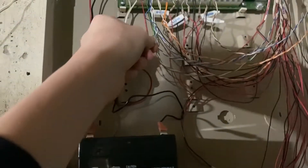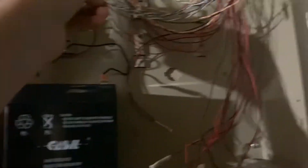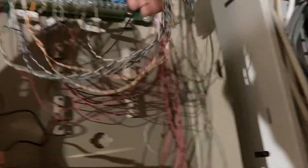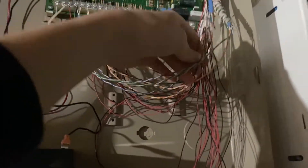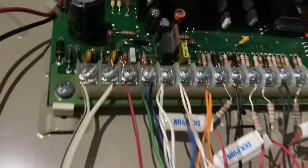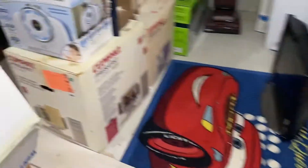Contacts three and four - I don't have the schematic right now but it's three and four. Right here is pin number three, and this is the wire for the speaker which goes into a white wire. I'm pretty sure this is the negative. We have to disconnect this red wire and this black wire to get rid of the external sounder.